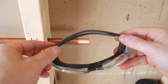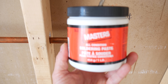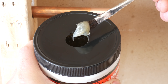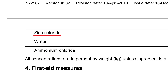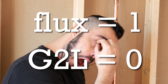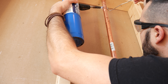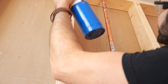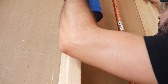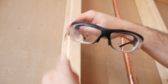Number 2 is another safety precaution, and that's to use safety goggles. This is flux. Flux is an acid — it contains zinc and ammonium chloride, and trust me, I've gotten a lot of stuff in my eyes in my career, and flux is the number one winner in terms of pain. This is more of a concern when you're soldering overhead, as when the flux is heated it turns liquid, so if you're directly under it, you're bound to feel the pain. Just wear some goggles when you're soldering.